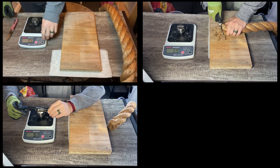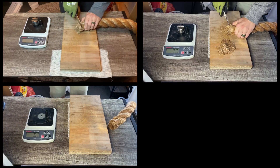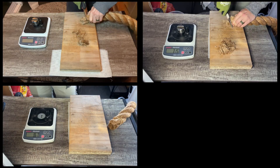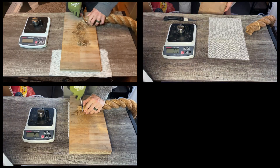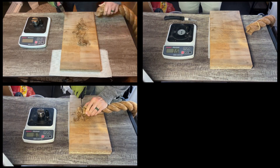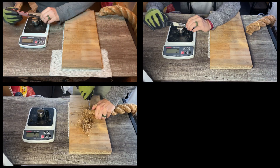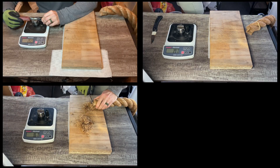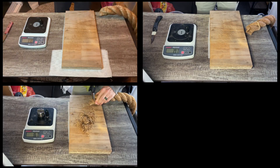I've taped the edges so that we have about the same amount of edge length, but do be aware that rope cut testing rewards aggression — getting through those rope fibers is a lot easier if you have a really aggressive edge — and it also prefers wear-resistant steels. I'm not making the claim that an edge sharpened coarse on one side and fine on the other will always be 100% higher performance. I'm just doing some fun testing to see which steels respond to it best and what edges perform best in this rope cut testing, so I can carry that data into my carrying and EDC.